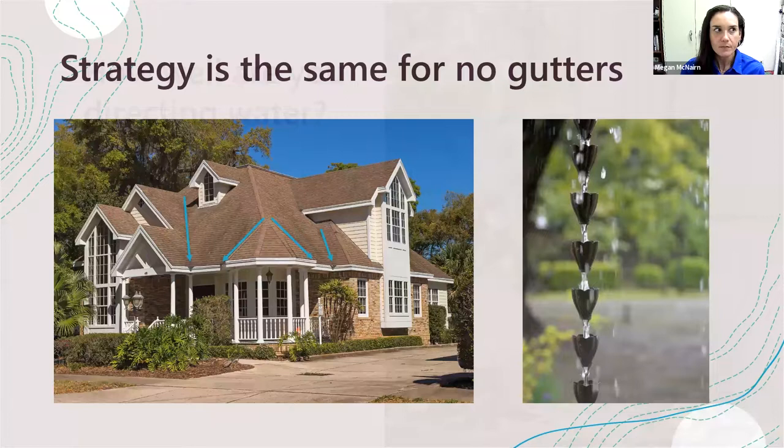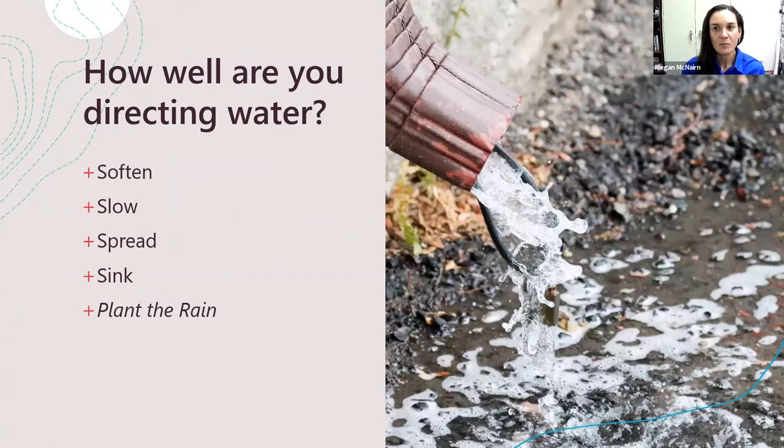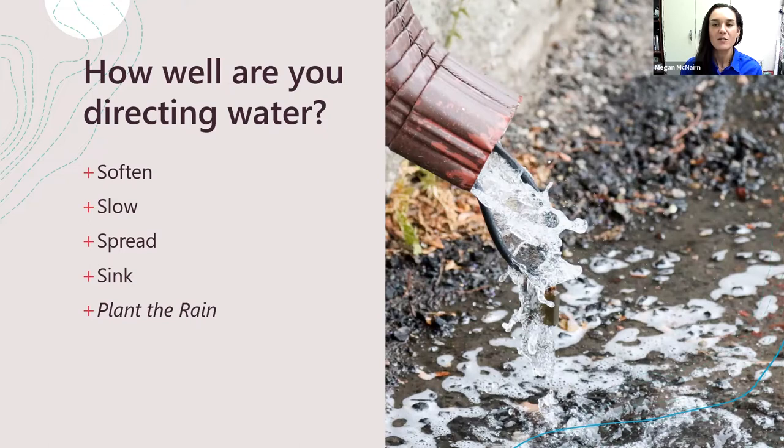When I ask how well you're directing water, I'd like you to take a look around, because with our abundant rain I often find problems when looking around people's houses. Definitely fix any obvious issues regardless of whether you're putting a rain barrel at the end of a downspout or not. We want things to function effectively. Please clean out your gutters, because those are one of the most common but frequently missed sources of mosquitoes in the landscape. Water has a very high erosive force when it comes out — you can see it starting to pit away the asphalt underneath this downspout.